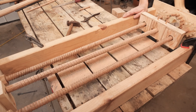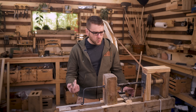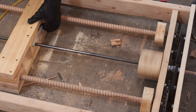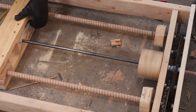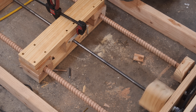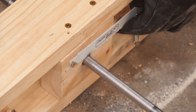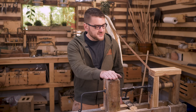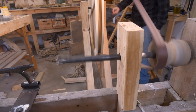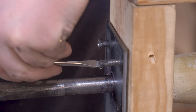All that wobble does limit how fast we can run it. Updating to a more modern technique — taking the lead screw concept, putting it at the bottom, using just one screw to cut a consistent thread into whatever you're working on — is going to be a much faster approach. The biggest issue with DaVinci's machine is that it is incredibly slow. That's why, when faced with having to completely rebuild the machine multiple times to reverse the thread, we opted for the more straightforward way of using two sides of gears to make one screw. We also ran into issues with the holes in the wood getting wider, which explains the general shift to making the whole machine out of metal as metal became cheaper. Until then, even using soft pine, we just have to reinforce the parts that start to wear with metal.